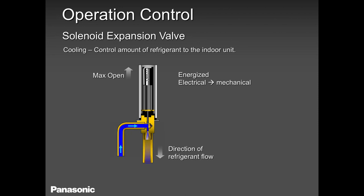Because I'll tell you, all that crap that you're flushing out of that coil can come and get stuck here very easily. Back in the day, when we had a compressor burnout, to be successful, we would change the cap tube, because it's very hard to flush a capillary tube. It's possible, but it was very difficult. And it was not expensive, so we would just replace it and move on. And the system would perform as good as new with a new compressor and a new cap tube. So in this case, always remember to do that. Get this out of the equation, flush the coil, blow off the coil, then put this back.